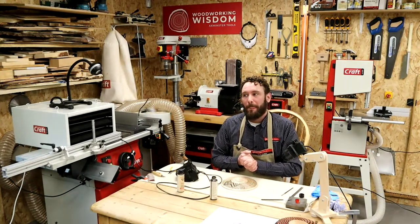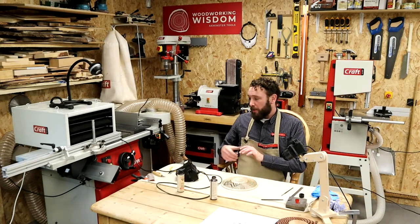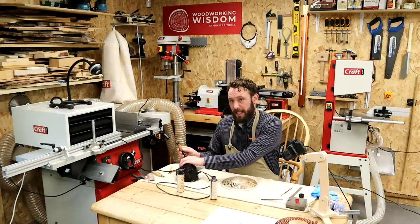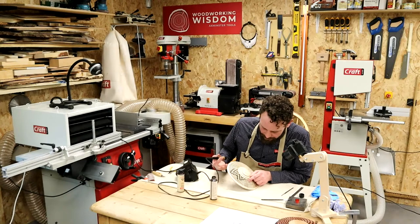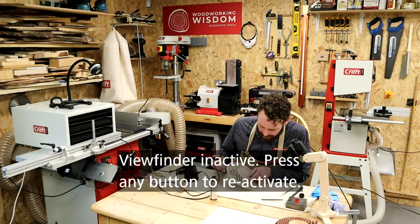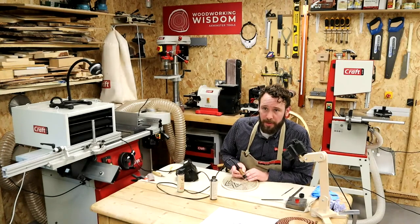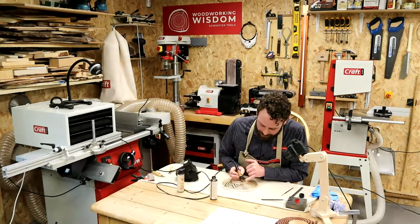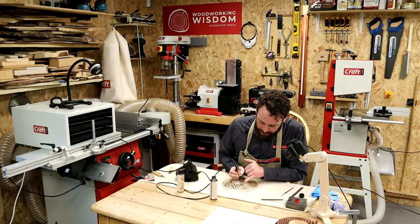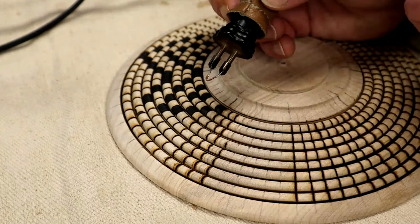He said, when you say force the point in, how much are we talking about? So it needs to get right down into the bottom of this valley. Let's come back onto camera two, where we've got that bead forming tool. It's quite deep in there. And the shape of the tip is quite important. If it was something rounder, it would never reach down the bottom. I've used a bit of abrasive to shape this tip so that it gets right down into there.